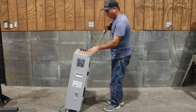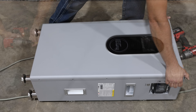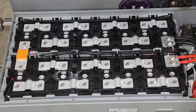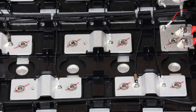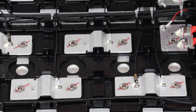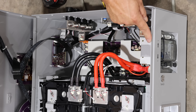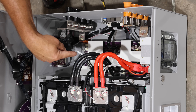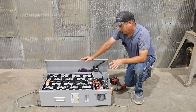Before we install this in the basement, let's open it up and see how well it's built. Inside there is a total of eight batteries in each row — 16 batteries total in series. Each battery connection has a wire that goes back to the battery management system so it can monitor the voltage level of each cell. In the monitoring software you can see parallel battery cables going to the breaker on the side and up to the 600-amp positive bus, and parallel cables off the negative down through the BMS and up to the negative bus bar.